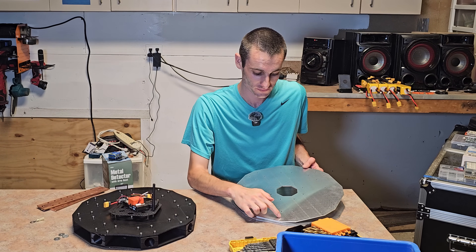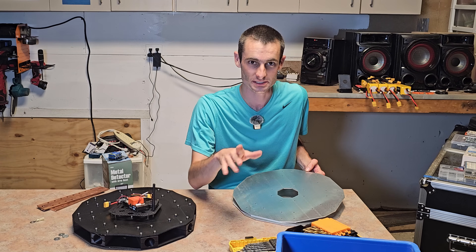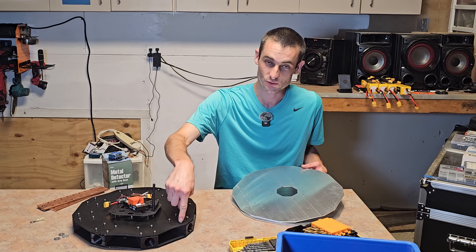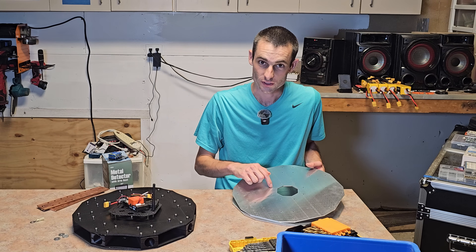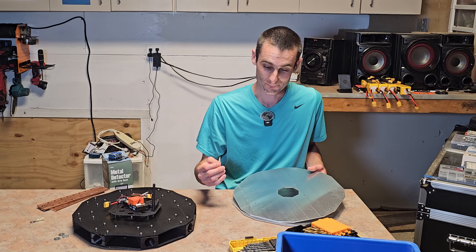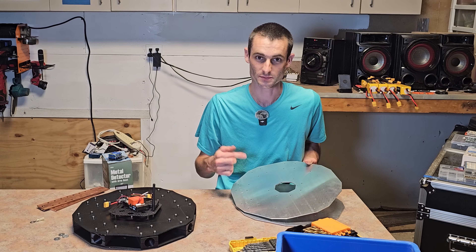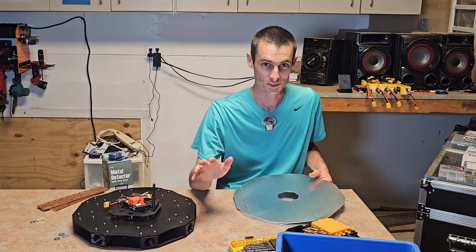Here's where the fun really starts. I specifically made these holes exactly four millimeters instead of compensating for 3D printer weirdness, because I expected very precise milling. These screws are 3.9 millimeters in diameter, so they should fit with 0.1 millimeters to spare — but they don't fit. So I'm going to have to go through both plates and drill out all of these holes myself again with my drill press.